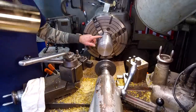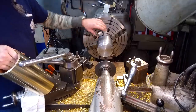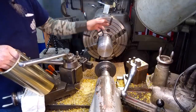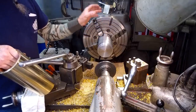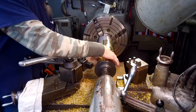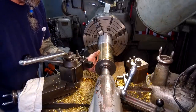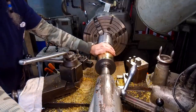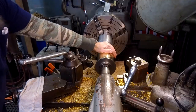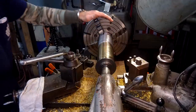Now, I had this 5-inch piece of material, and I chucked it up so that that goes into the jaws. So I got the full length of the jaws connecting it. Got it dialed in hard. And then I machined this register out here so that it receives the bearings. And then I can rough both of them off and then let them cool out of the machine and then put them back in here at cooled down temperature for the finishing.